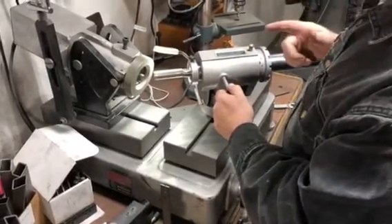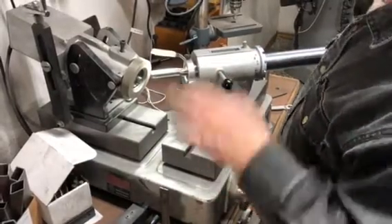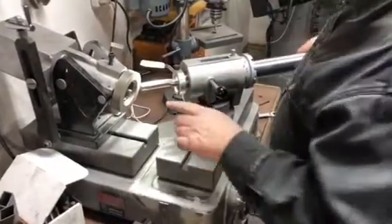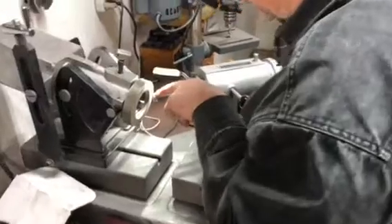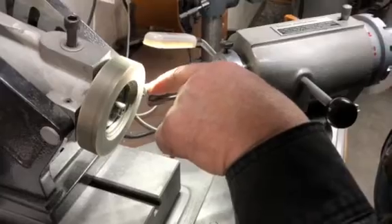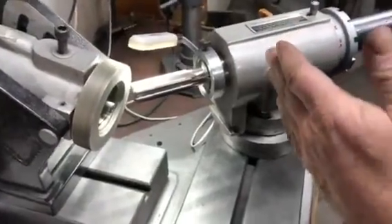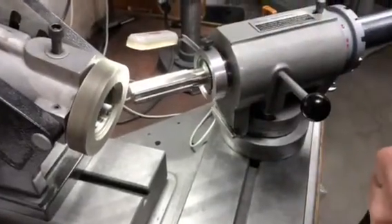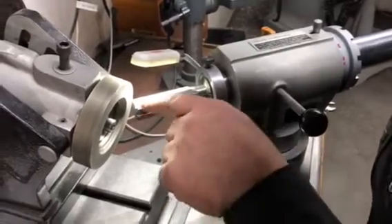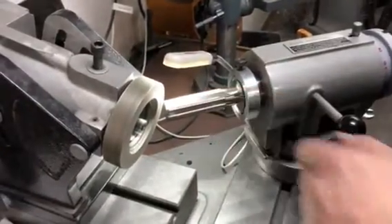Always pick up the original grind. With regards to sharpening reamers, the biggest mistake you can make is letting them get too dull. A reamer has a circumferential land just like a drill. So if there's any deterioration on this surface — your margin — then you have to actually grind past that. Just grind the end of the reamer off square once you know the angles to reproduce, and then start over, because if this diameter is small, it'll just rub and you won't have a nice bore.